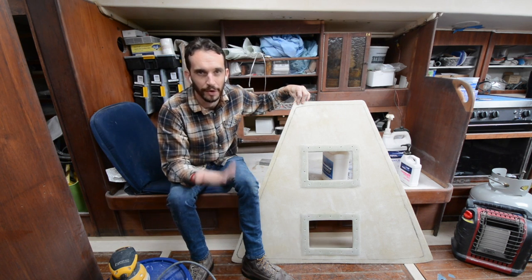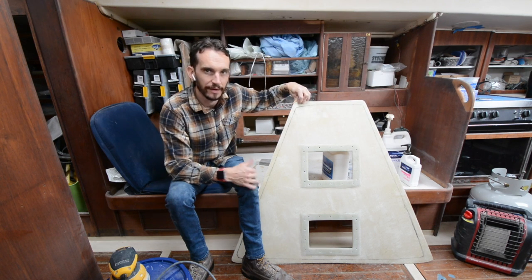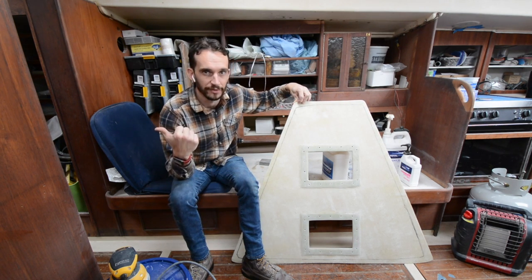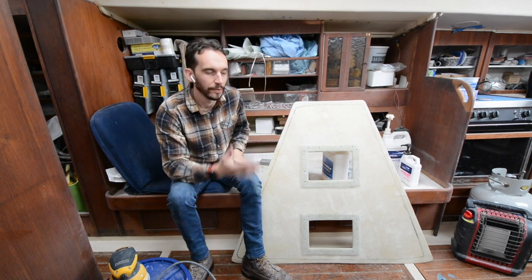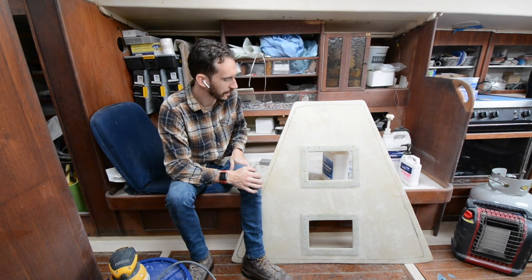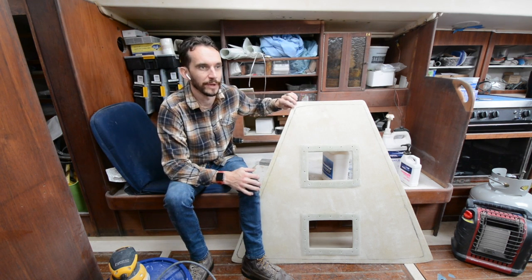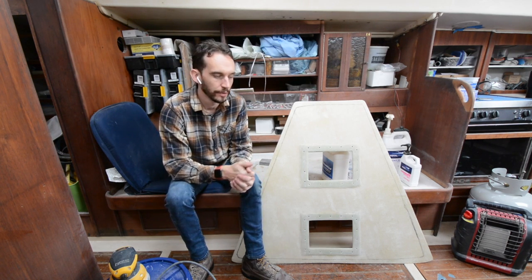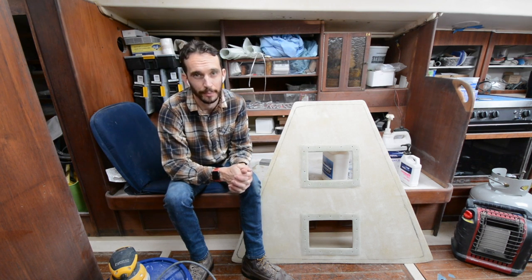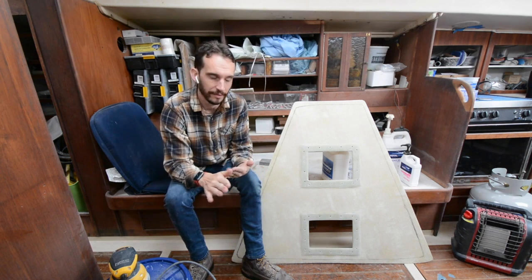The epoxy will bond to epoxy just fine, but what I would really like is to have this fiberglass layer bonded to that fiberglass layer just for strength purposes. And then we'll be putting more fiberglass over the top, so that's going to be the real strength of the adhesion. But this will be like a really nice bonded gluing that will prevent it from leaking, or water getting up in those cracks and just sitting there. We don't want that, so it'll be a really nice smooth bond.